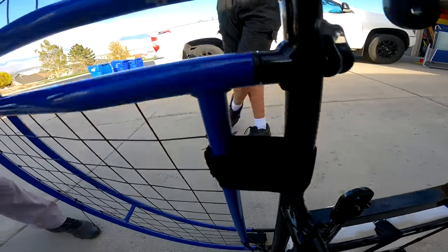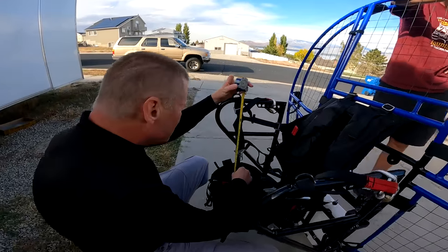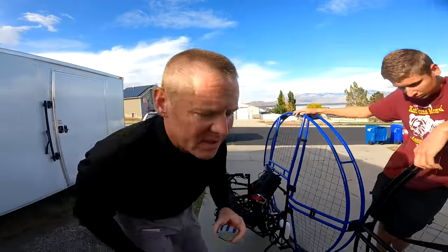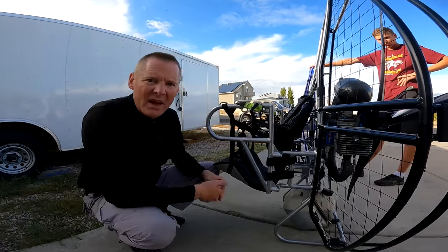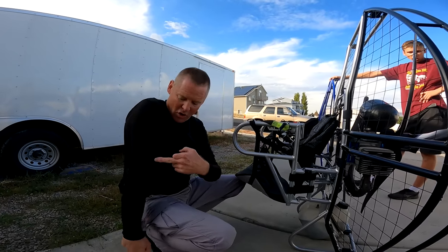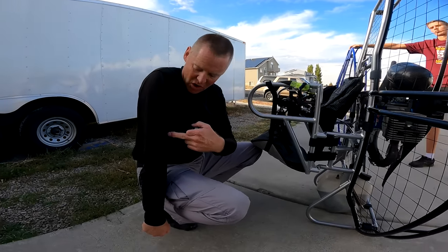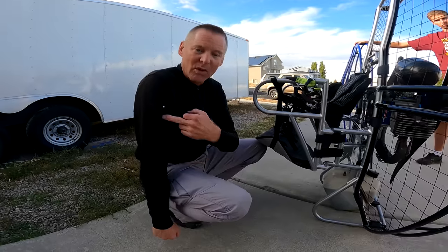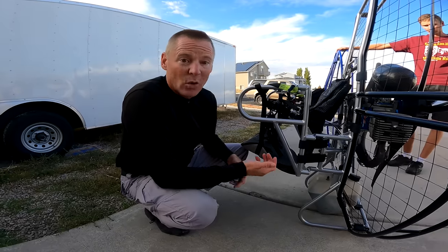This velcro is literally at an angle — what happens when you put tension on something at an angle and add a pressure point? It just rips right in two. Measuring the comfort bar: the competitor is an eighth inch under 33 inches and about an inch and an eighth lower. Certified height hook-in points are really critical — they're designed by glider manufacturers so that your arm only extends so far below that point. If a newbie buries the brake, the glider shouldn't stall. If you raise that hook-in point you've thrown the certification out of whack.